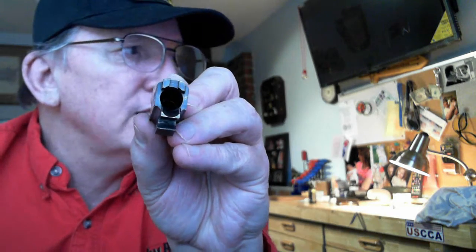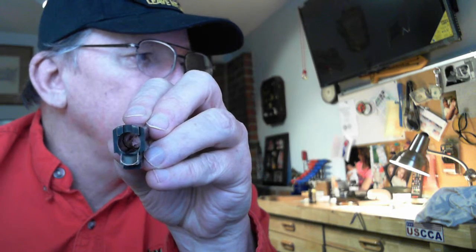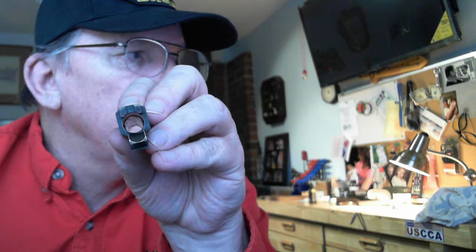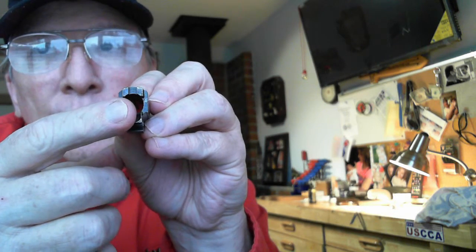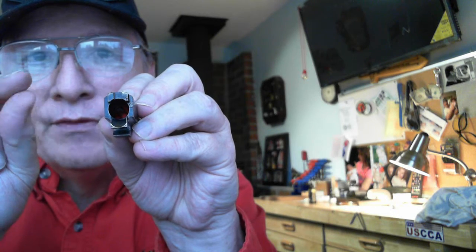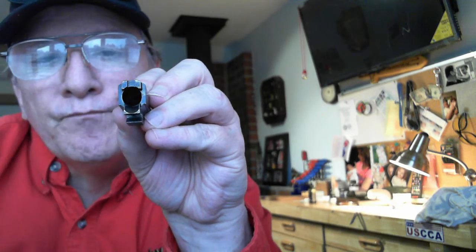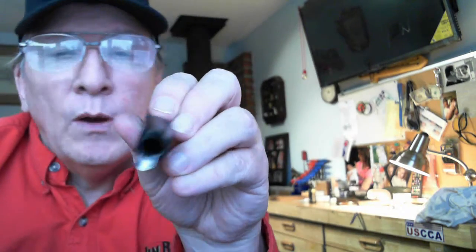That's what this whole video is about, what I actually had to do. Then I went a little bit more. As you can see, I went inside the barrel and polished the whole thing. On the Bersa, the opening here for the chamber, the reason I had to open that up a little bit and do that on the sides is because the chambering on that throat area was a little bit oblong, just a little, and it was causing some problems. That's what this video is all about. I hope that answers your question.